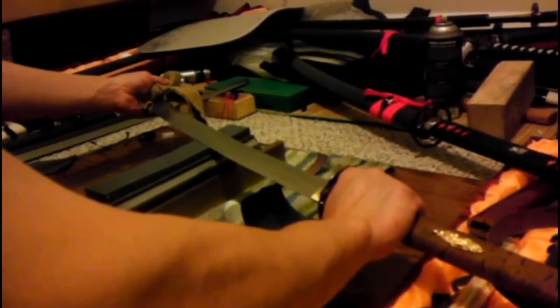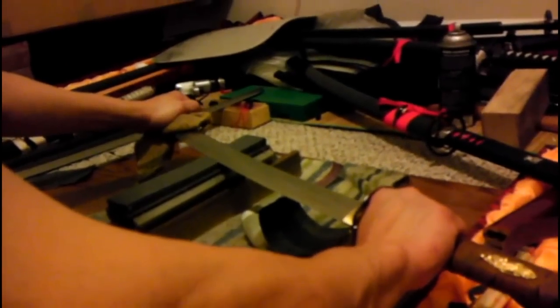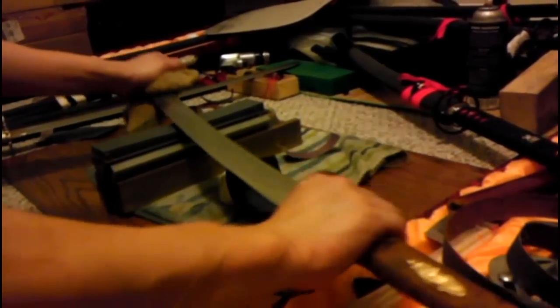The way you reprofile a blade, you put a towel right here to secure, or right in any area, make sure that your hand is out of the way. Now, I explained before, basically, I'm trying to bring down the convex. So when you get on the stone, most of the time, you're just in a rock back and forth motion. Your hand can have a slight wrist movement if you need to retain that convex. But most of the time, you don't really need to do this.